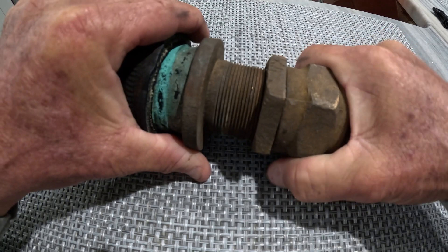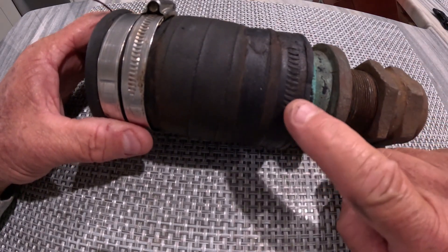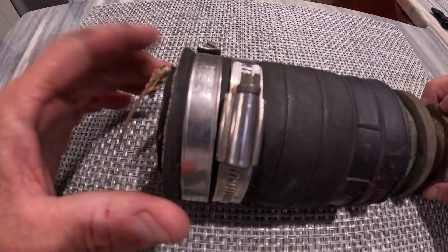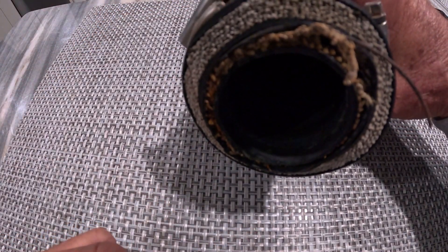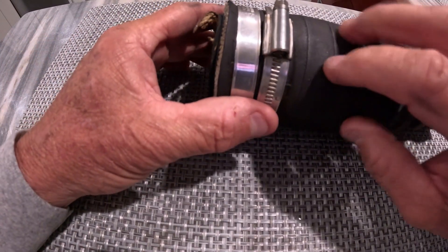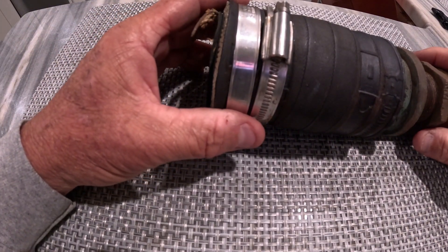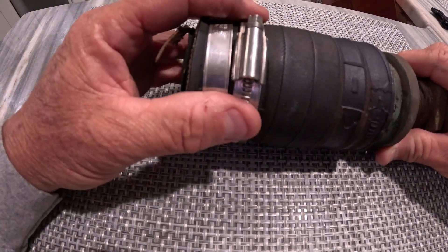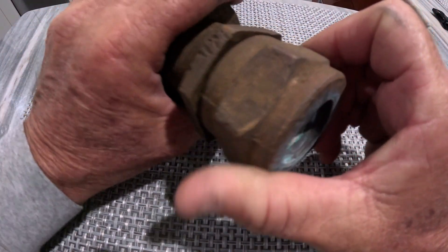I also pointed out in the video — see the hose clamp here and here and here — these are the proper hose clamps. When you put this on the fiberglass tube that comes into the sailboat, which your shaft goes through, you want to put this in boiling water first because it's way too hard — those clamps aren't going to clamp it down. You put it in boiling water so it's pliable, then slip it on your fiberglass, put your hose clamps on, tighten them down, and it applies better.